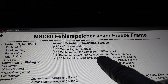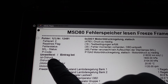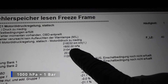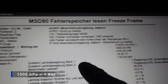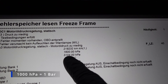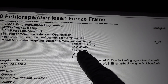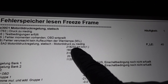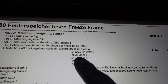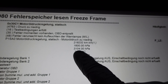It also says this error will not cause the check engine light to turn on. The big code is 15A0. The additional data shows 'Ist Öldruck' — actual oil pressure — at 1600 hPa, which is 1.6 bar. The next line is 'Öldruck Sollwert' — desired value — at 3.1 bar. At first glance that looks terrible, but the DME or INPA does not account for one bar of atmospheric pressure, so the actual reading is really 2.6 bar — about half a bar difference. Not that horrible.